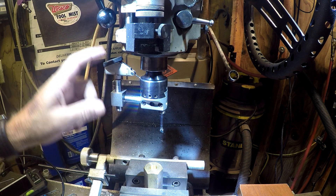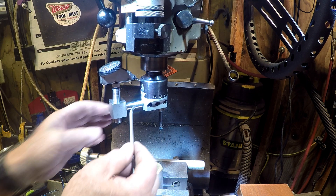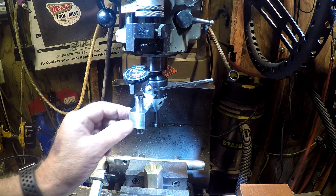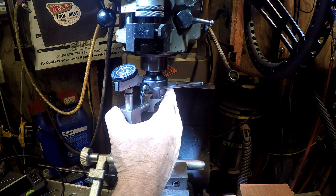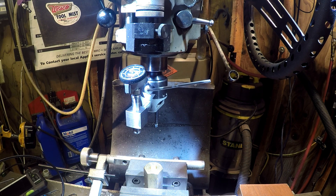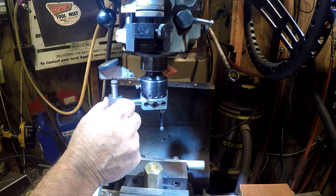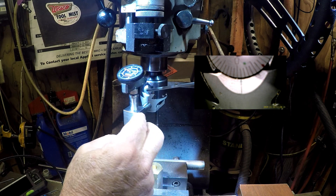To do that I needed to make a taller stem. It could work either way — you could downturn and raise the indicator up — but this gives plenty of room. I happen to have a hacked-off wrench here, but it gives you room to reach in and do your adjustments and read the gauge. Using an allen wrench rather than a driver gives you a much better view of the dial — something I learned from viewer comments — and also helps with torquing. Typically you don't have a tool in this side anyway.